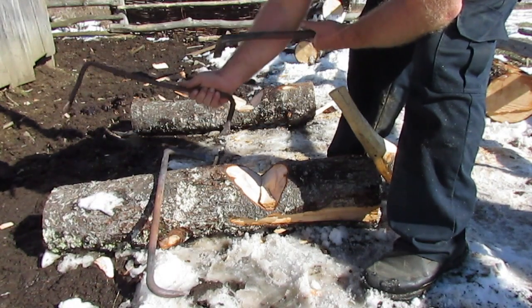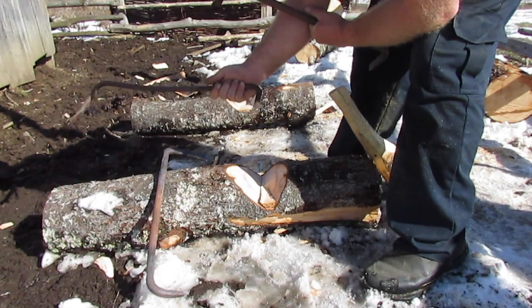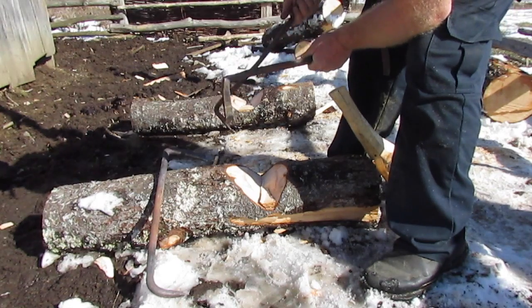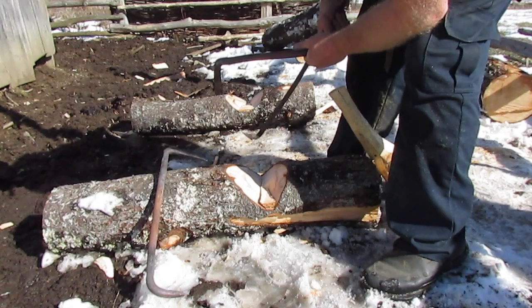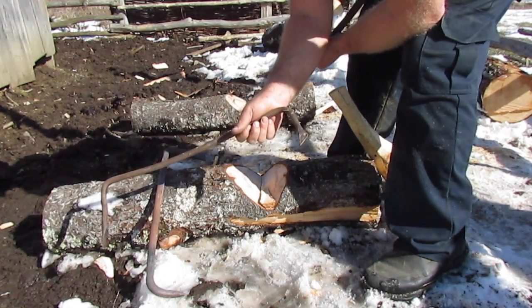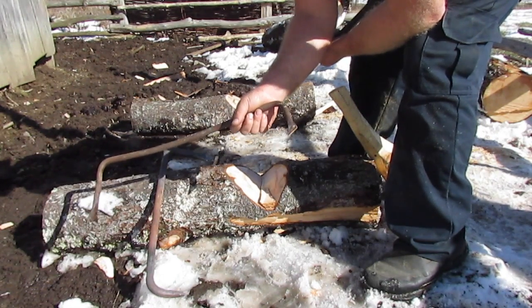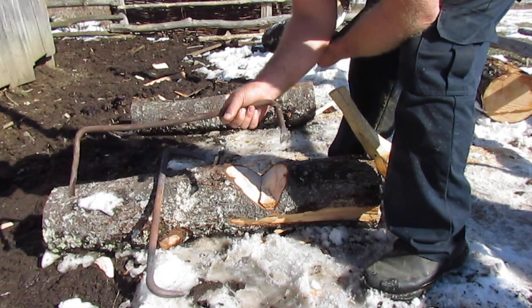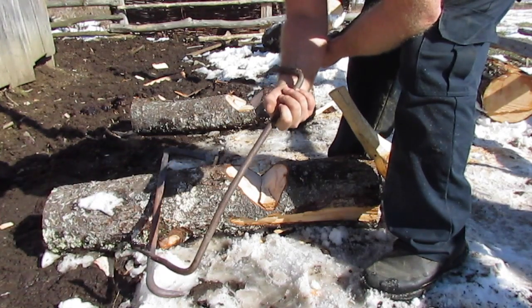And you can see I did the taper all wrong and I worked it too much, and you can see how brittle this is. They've both snapped a little bit because I worked the metal too cold and made it too brittle. But I've hewn a lot with these basic log dogs, which I made in a dirt hole forge with my splitting maul as my anvil and a hair dryer as the blower. So this is not high tech.